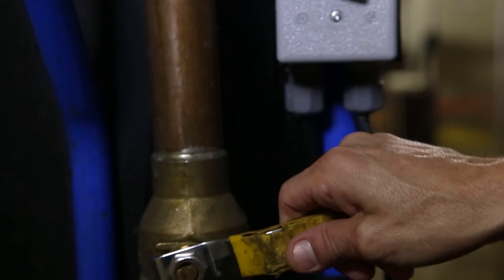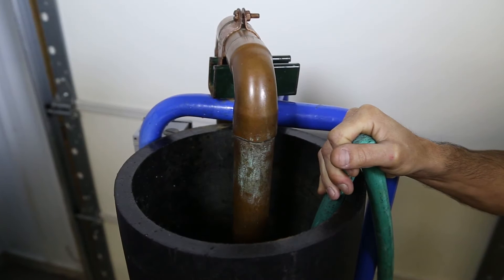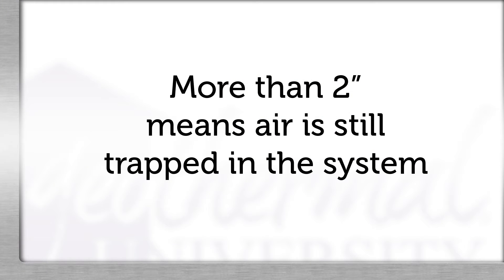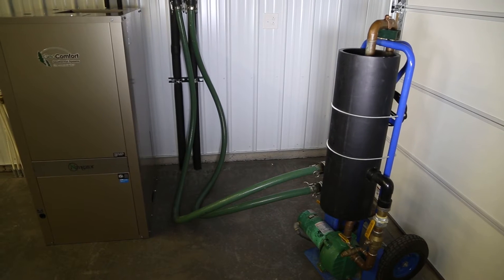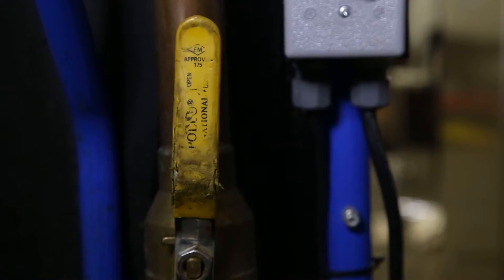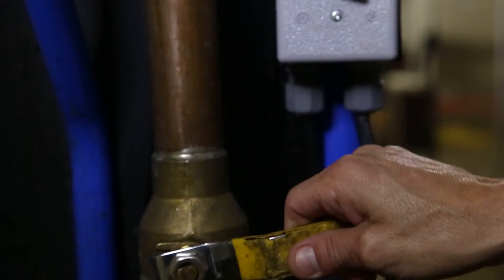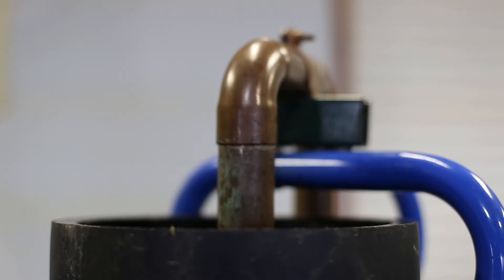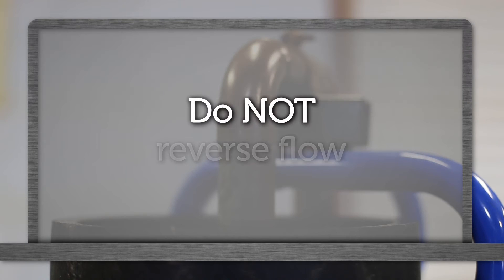It helps to deadhead the pump every so often and observe the water level in the reservoir. Once all the air is removed, there should not be more than a one to two inch drop of water level in the reservoir. If there is more than a two inch drop, air is still trapped in the system. This is the only way to tell if air is still trapped in the system. To deadhead the pump, shut off the return side ball valve on the flush cart. This will create a surge in pressure to the system piping, helping to get the air bubbles moving. Do not reverse flow during flushing.